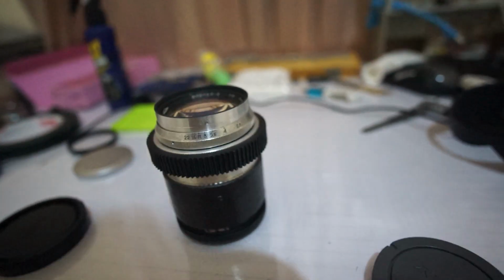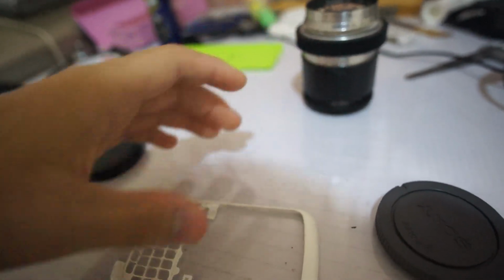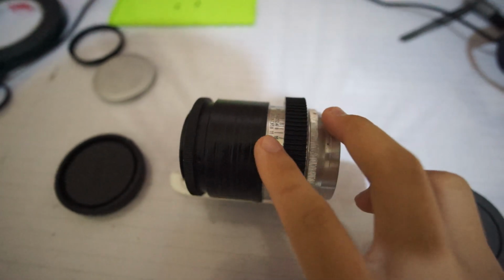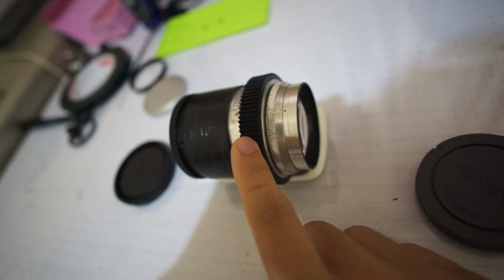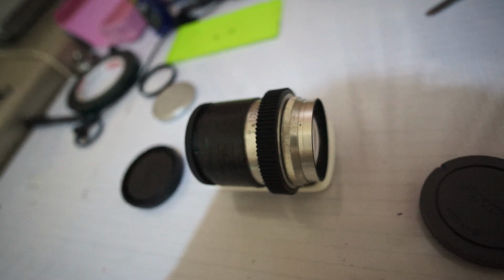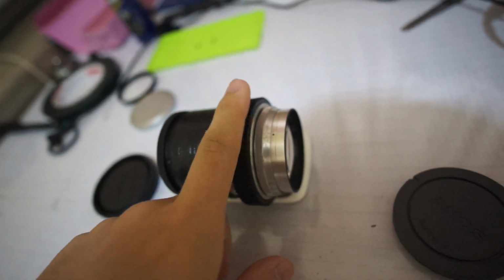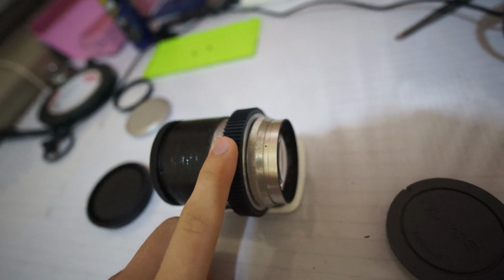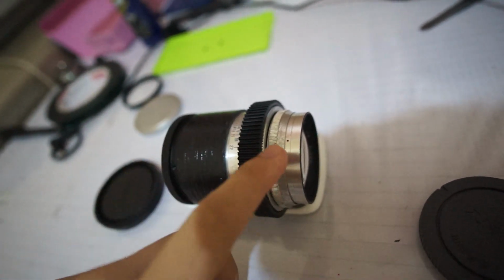If you recall, I used to have this as a Contax RF version. So let me take this BlackBerry frame, put this right here. Now this bit right here is the original lens. This thing I 3D printed out of ABS plastic. This is pretty strong. I chose ABS because it's more rigid than PLA, even though it actually suffers a bit under the sun. And I also wanted to grind this thing down a bit, so I didn't use carbon. If I did use carbon, I'd have to grind it really hard to get it to fit perfectly. This is all friction fit, so that's perfect.